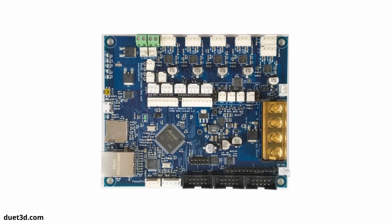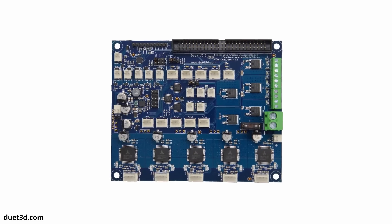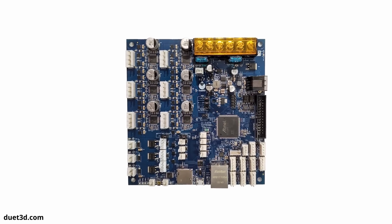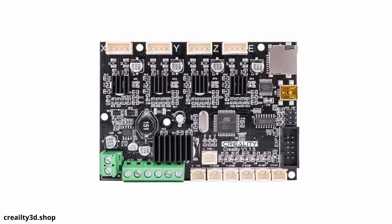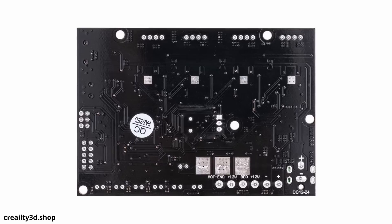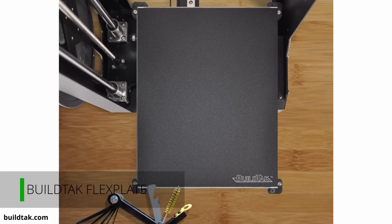The Hemera has a custom motor housing with T-slots for easy mounting and accessories. This is easily one of the best all-in-one extrusion systems on the market today, and the $140 price tag is an amazing deal for what you get. Up next is the Duet 3D motherboard. This does require some rewiring, but the benefits are well worth it. Duet 3D boards come standard with high-quality stepper drivers, are 32-bit, and have Wi-Fi expandability for extra accessories. The price is a little high at over $170, but it gives a lot more control over your printer. Some companies also sell boards you can simply drop into your printer with little to no firmware tuning — Creality has an upgraded control board for the Ender 3 with silent stepper drivers that you just drop in and plug back in.